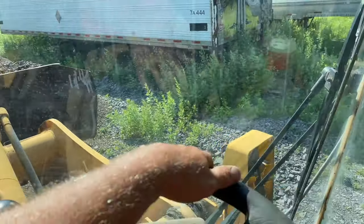Well guys, I'm just over here picking up Kevin the Kubota skidster. Figured I'd show you how the slab looks. This is the finished product here. Got all our relief cuts in. There's a cut here right where the garage wall is gonna be, and then the garage is cut down the middle both ways, and then it's cut down the middle that way, and there's two more cuts that way. Got our foam detail. It's gonna be a flashing going over the foam, under the wall. That's how they're gonna do it.